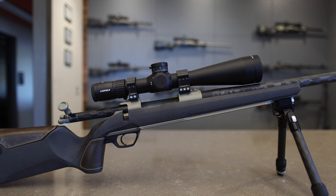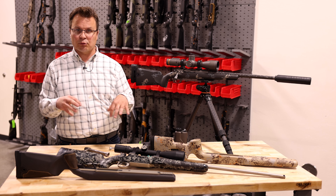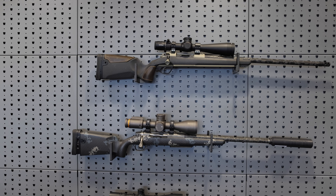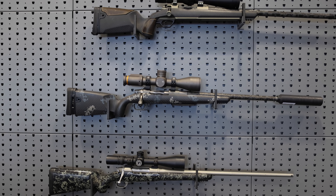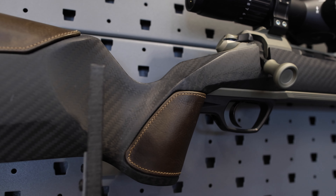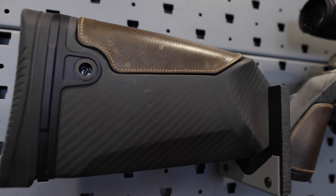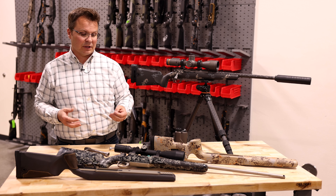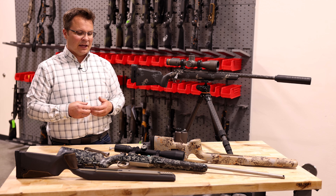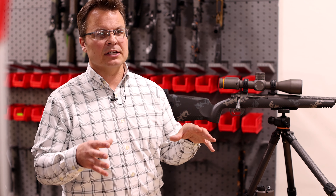We understand why a lot of companies choose to just assemble — to be custom gunsmiths that take excellent products and combine them. But from our experience, combining a receiver, a bottom metal, a barrel, and a stock from different manufacturers — even though we had a hand in specifications and played a pretty big part in fitting and customizing — it still took a lot of effort to make things function and work right. Things like a specification on a sear and how that affects the trigger relationship, the magazine box, or even bottom metal fitment to a rifle stock — all of those things matter and are challenges you have to deal with as an assembler-type gunsmith.